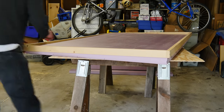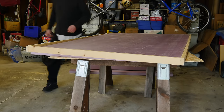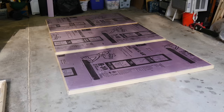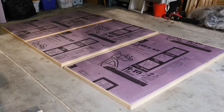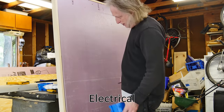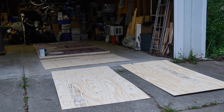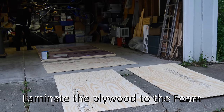Here you can see the wooden frame fits around the pink foam pretty well. I made those wooden strips exactly two inches — the thickness of the foam. I did end up getting one sheet that was slightly thicker than the others by accident; they were all 150 but one of them was a 250, so I had to shim that a little bit later. Now, one wall is going to get electrical in it — there's going to be an outlet box on the outside for two outlets to power the portable hard drive and my laptop, plus power inside for a monitor and a dimmer switch to control the light.